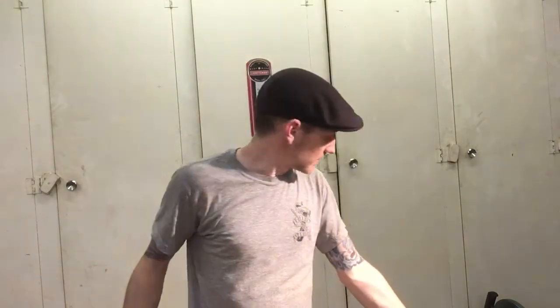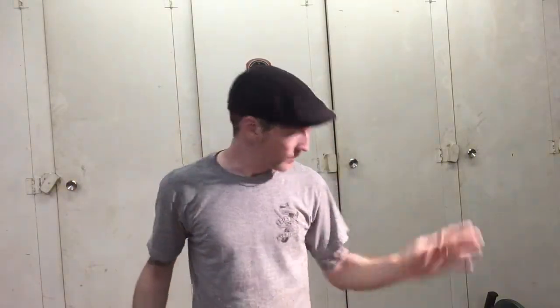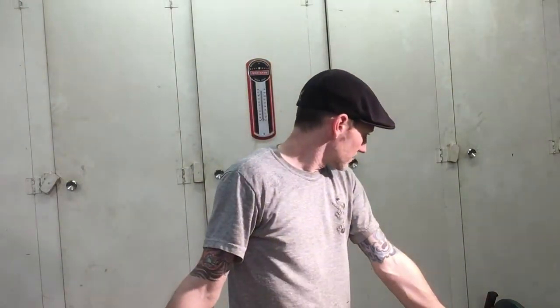Okay, so there you go. I'm going to call that a win, because I got more projects to do. The one thing you may have noticed is that the guard doesn't come back down. And that's just because when I put the spring on, I didn't realize it looks like you have to spin it a half a turn or a full turn or something before you affix it, and I just put it straight on. So it has enough oomph to push it down most of the way, but then there's no springing left.